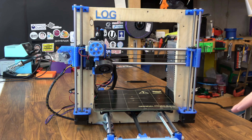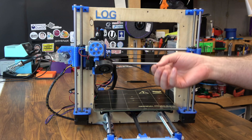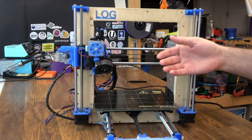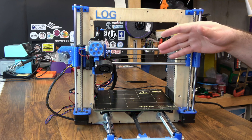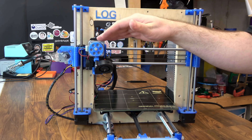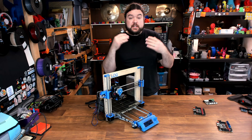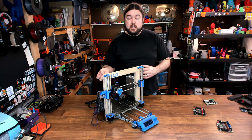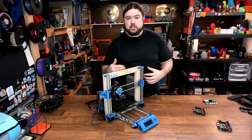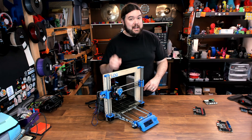Being able to level up on the frame is a really nice feature. You don't need the smartest driver — you can do it with a 2208, and you don't necessarily need sensorless homing or a Z probe to use it. But what if your printer is like LOG, which isn't necessarily all that square — the two top holders might not be the same distance from each other. If you do have a Z probe, there's a way around this. For this next scenario you will need two Z drivers — one on Z and one on E1. This is the biggest question I get: how do I set up this configuration to work correctly? They will work independently, so we can use the Z Steppers Auto Align feature.